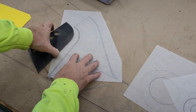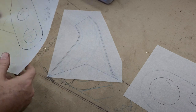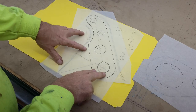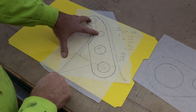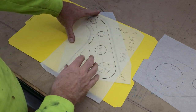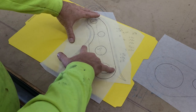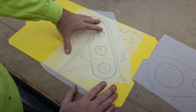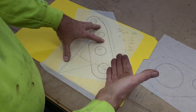On the inside of the frame I'm going to have a cross member that's two by three that attaches here on this corner. I'm going to do a fish plate gusset, and what that's going to do is tie this piece into the two-by-four tubing that goes here and the two-by-three tubing coming off up here. The problem is this big piece I'm making out of plate is a pretty large side profile — there's a lot of unsupported area. I don't want any flex in the chassis, so the plan is to do gussets on both the inside and the outside of this junction.